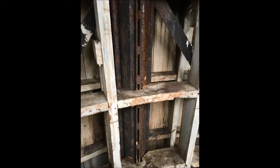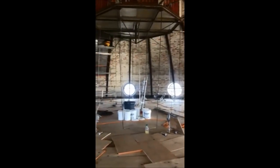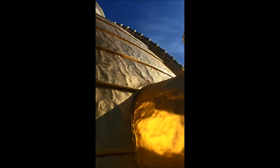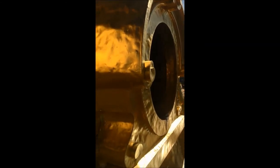What is the entire dome itself constructed of? The dome is framed with structural steel S-shapes, kind of like a railroad rail, and they're rolled into pies. There are 12 pies around the dome — you can count the roundel windows, there are 12 of those windows, and those center in a pie shape. Then they're infilled with brick pavers that create the frame of the dome, and it's sheeted with copper, just plain copper about a sixteenth of an inch thick, and then the gilding is on top of that. Everybody sees the gilding and the sheet metal, but you don't necessarily know what's inside holding it up, but there's a lot of mass up there.